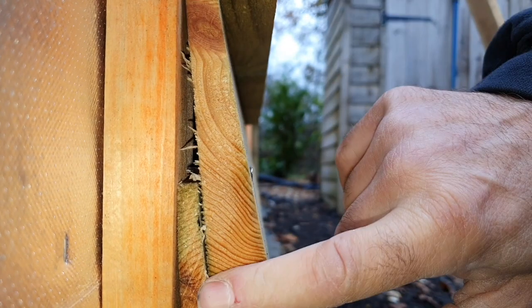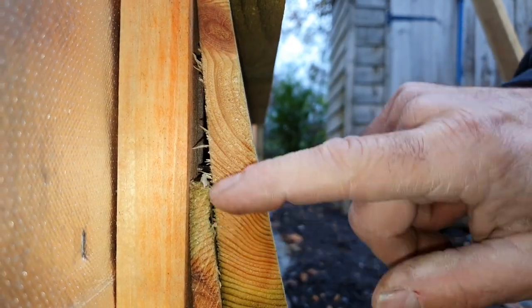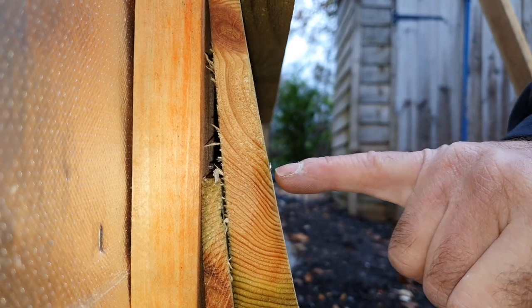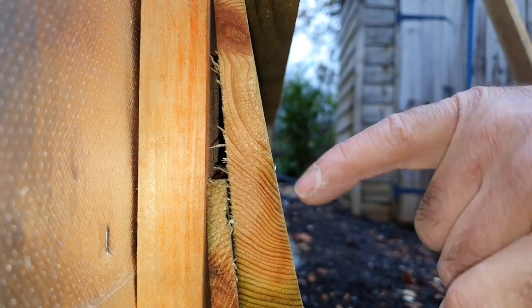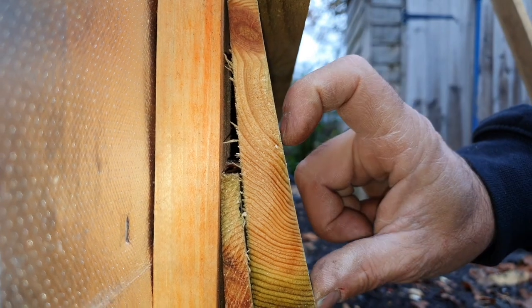Here's a section through — I've just put these here to give you an example. There's the cover there, which allows for shrinkage. There's the nail there, and it comes in just above the top of the other board. So that's the correct way of fixing it.